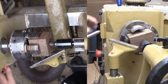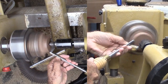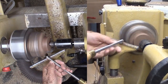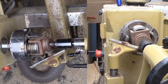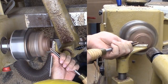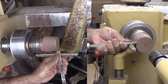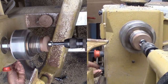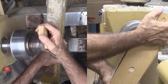With the last revision to the infinite axis chuck, I added a 3/8 inch bolt to enable more turning options and then a replaceable mount for the wood to be turned. I used maple for the mount, thinking maple would retain the threads, but the maple did not retain threads well enough for this usage. So I purchased a 3/8 inch T-nut that I will embed in any wood. I found a piece of walnut big enough to fit my scroll chuck — rough rounding and cutting a tenon on one end. A threaded insert would be another option. Now I'm flipping it around onto the dovetail tenon to round off the other side, rough round and part off leaving a thickness of at least the depth of the T-nut. Then prepare to drill a shallow 1 inch hole the size of the T-nut's diameter and a through 1/2 inch hole the size of the T-nut shaft.